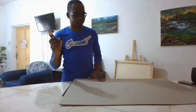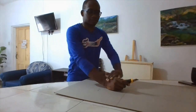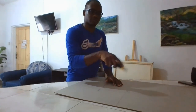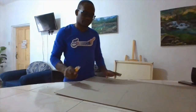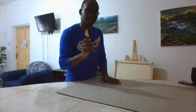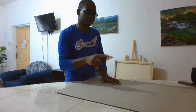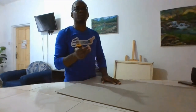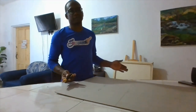Okay. Here goes. So we want to cut using the full length of our arms and not just our wrist. Alright? So you want to cut from the shoulder coming back down. Alright? So the first mark that you make is a mark. You're not trying to cut through the first time, you just need to mark the line so that you create a groove for the blade to follow through. When you do it that way, the second round is easier. You just mark until it comes apart.